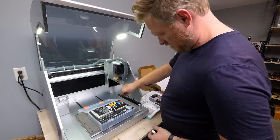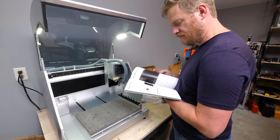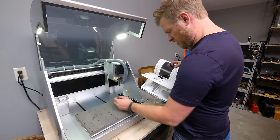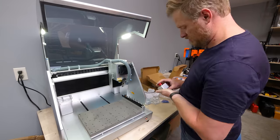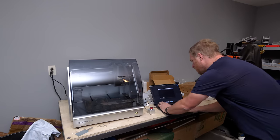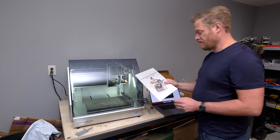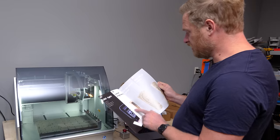This is an 1/8-inch, 30-degree, 0.2mm V-bit. That goes there. Charge the wireless probe — after the device is turned on, the yellow indicator light will light up as the wireless probe automatically starts charging. E-stop — with a connector like that I'm going to be able to figure out where that goes. Let's jump into software. I have the Carvera controller installed on my laptop, connected via USB. It came with an examples guide with some different projects to try.